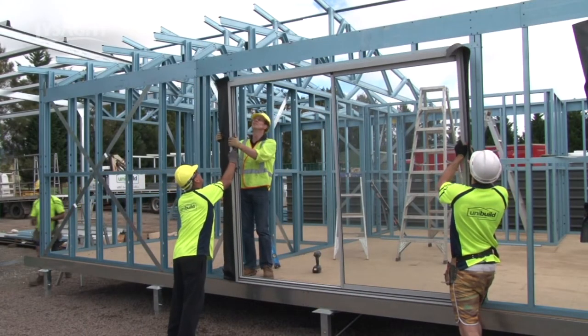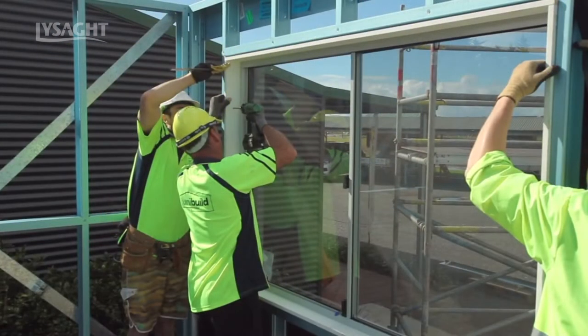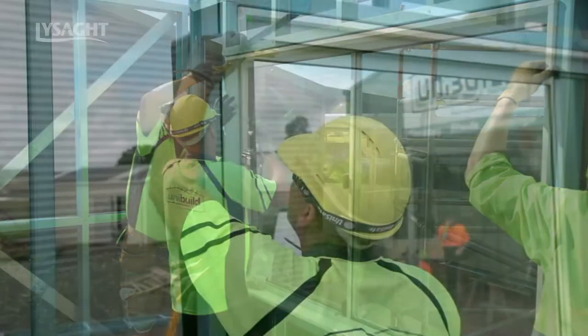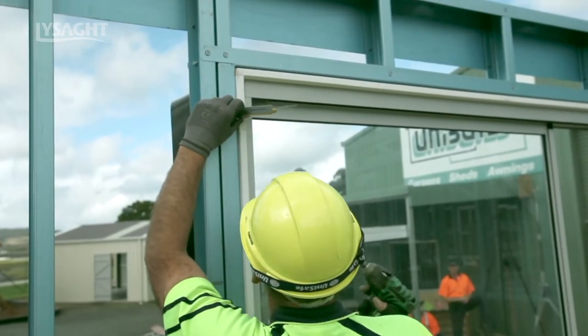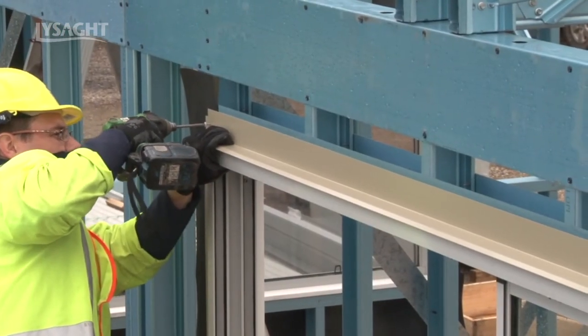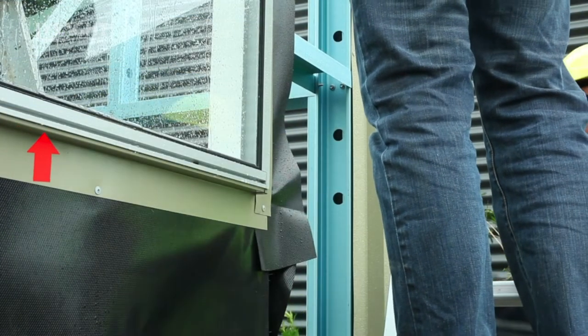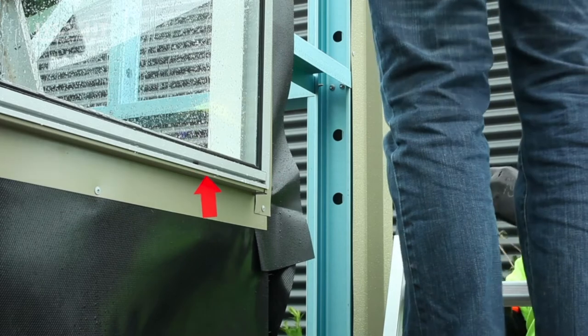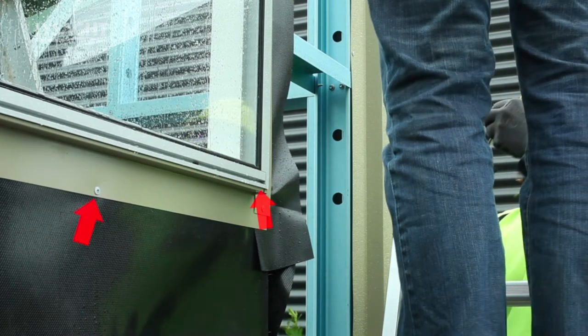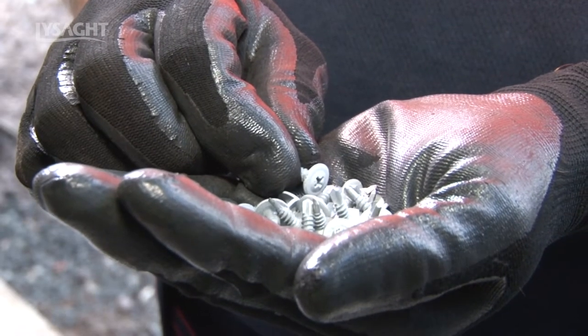Windows and doors are installed through the rough openings in the wall panel by using a tek-ended point screw through the timber reveal into the jam stud. Locate the window or door centrally in the opening. The preliminary flashings for windows and doors are now installed using a tek-screw to hold in place. On occasions, there are flashings that tuck in behind the extension and the outside flashing of the window. Use a tek-screw to hold the preliminary flashings in place. Pay careful attention to use the correct fasteners.